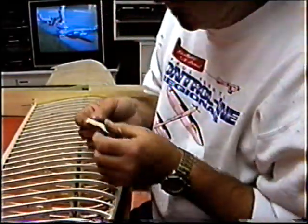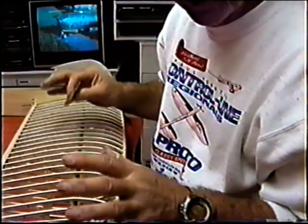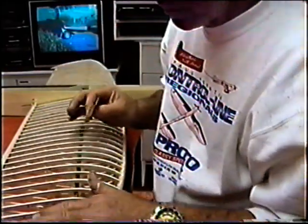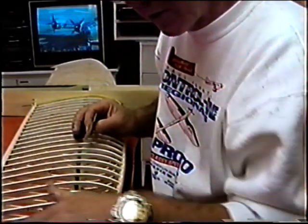But again, the best trick I know of is just to use your bare hand. A block is nice for doing the roughing out, but you don't want to use a block now. You want to have your finger touching each piece and find out where those rough spots really are.